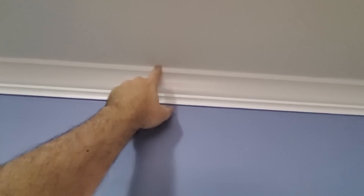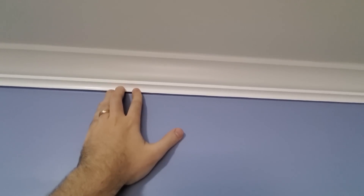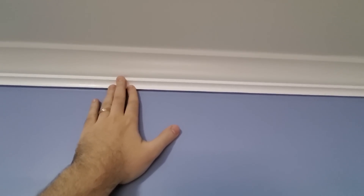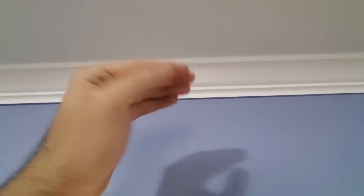For comparison, here is simple standard crown molding. With my hand tight to the wall and tight to the ceiling, there's no drop — it runs at a regular angle. I think this is 35 degree crown molding, but either way it's a traditional installation. If I wanted to convert this room to do the same thing, I'd take down all the crown molding, replace it, drop it down several inches, install the base molding behind it, and the new crown molding on top of it.